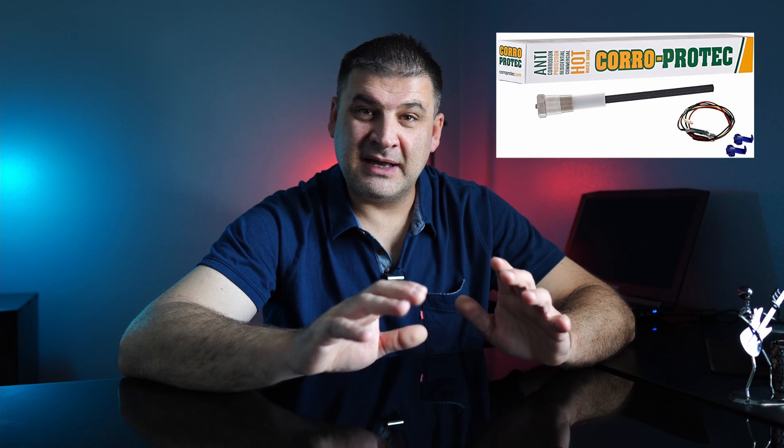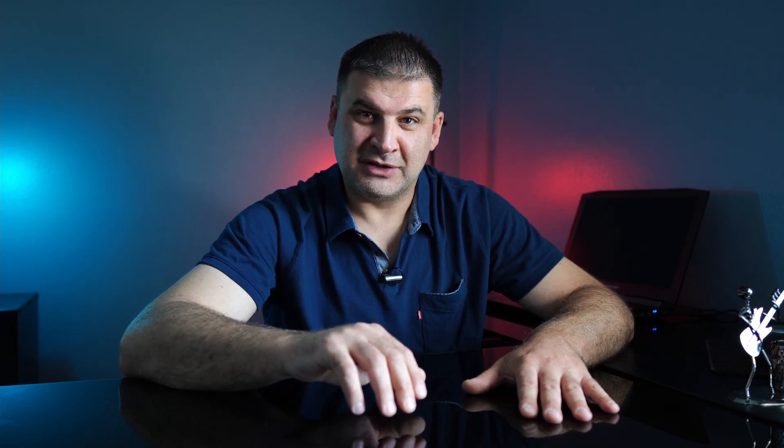The process that occurs inside the water heater that causes the dissolution of the anode rod is called electrolysis. As of today, there is a new kind of anode rod available that is based on electrical waves — it's an electronic rod that you screw into the water heater, plug in, and it sends the right electromagnetic waves that still protect your water heater, but the good thing is it doesn't dissolve — it lasts forever. I think it works; they use it in underground gas tanks at gas stations and with submarines. I will include a link to that new electromagnetic rod as well as all other parts you might need for this job down in the description below. I'll be really happy to see you get this job done yourself. Please subscribe to the channel, like this video, and hit the notification bell — let's build this channel together!